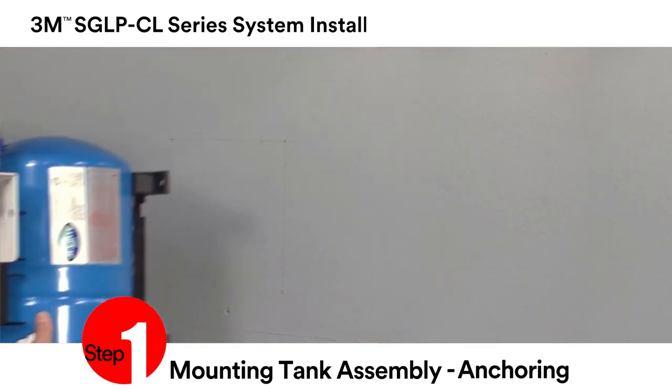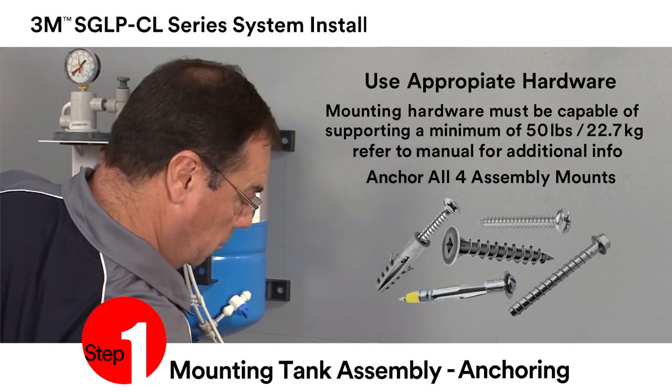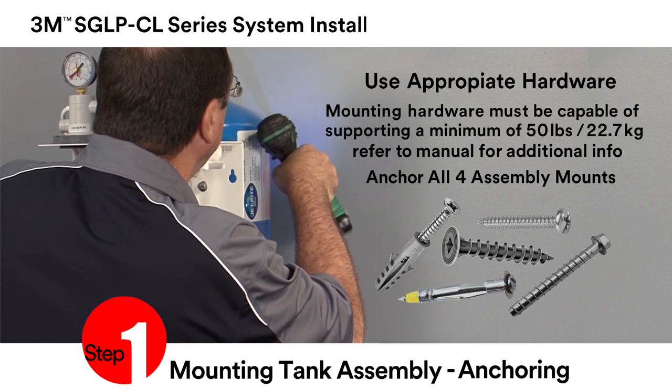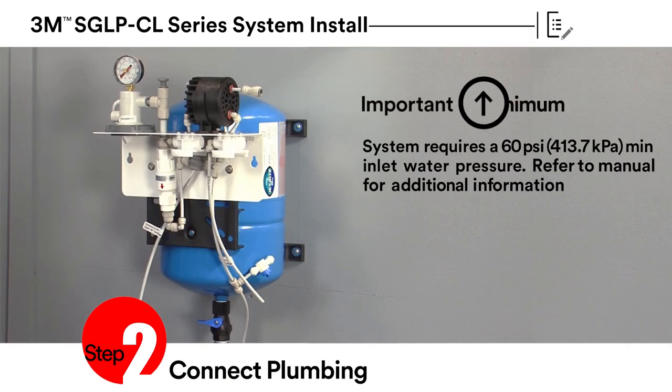The next step is to mount the tank and bracket assembly. Use appropriate hardware. It is important that the mounting structure and hardware are capable of supporting a minimum of 50 pounds or 22.7 kilograms. Be sure to anchor all 4 corners of the mounting bracket. Step 2. Connect the plumbing.